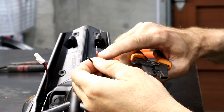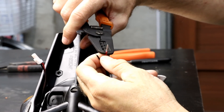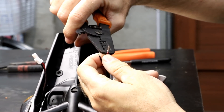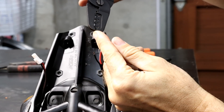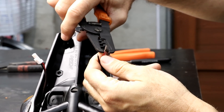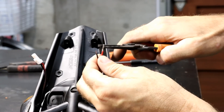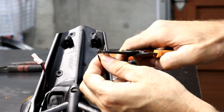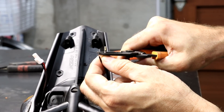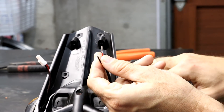Next you're ready to crimp the insulation part of the connector. Because the insulation pushed it out a little bit, it's important to press it slightly to make the prongs parallel. The tool has a flat piece like pliers which you can use to carefully press those a little bit. Then use the 1.6 die again — position the tool over the insulation part of the connector and crimp it carefully. You don't need to do it that hard; it's just to grip the insulation.